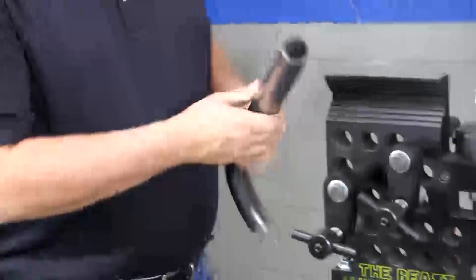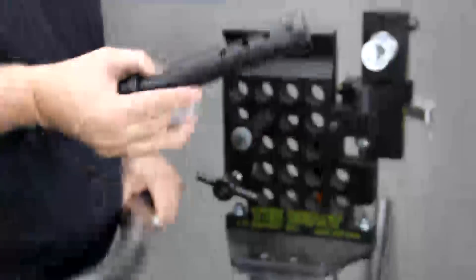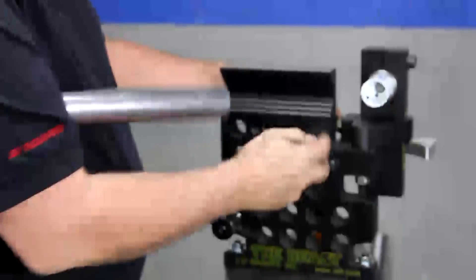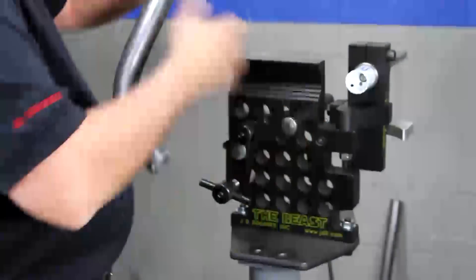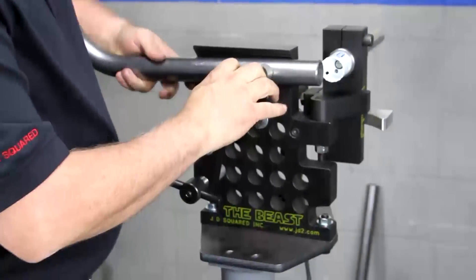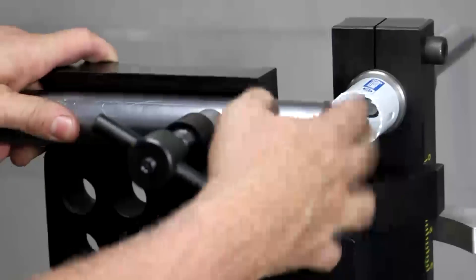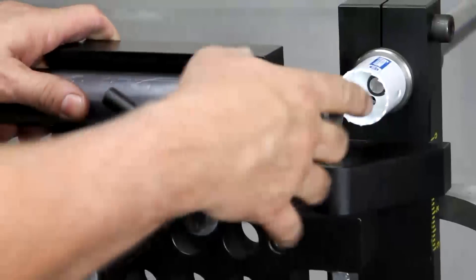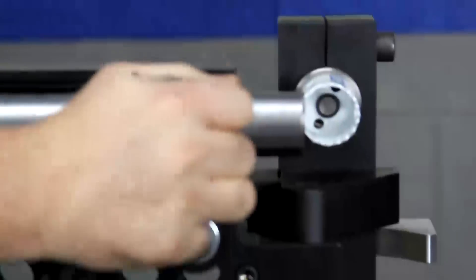This is 134 wall, inch and a half tubing. Another feature on this machine is it comes with two of these clamps here, and this is what allows us to clamp the tubing to the fixture up here. We hold the patent on this particular design — that's part of what makes it so versatile. We're going to load the tubing up and back off the little T-nuts. You don't want to put the tubing halfway into the hole saw. The best thing is to line up the hole saw on the ID of the tubing — if you do that, you'll get a built-in chamfer for welding, so you don't have to do quite as much grinding later on.